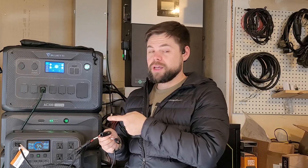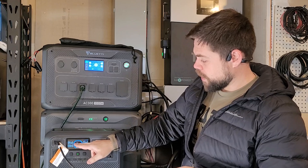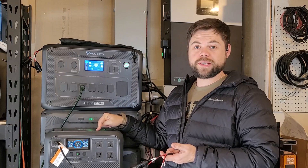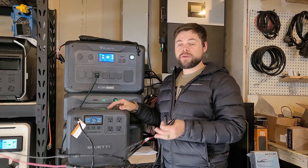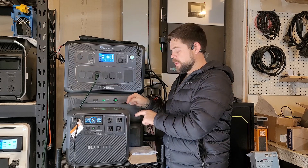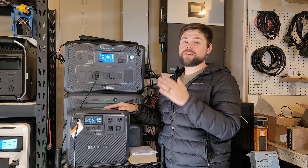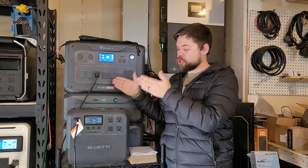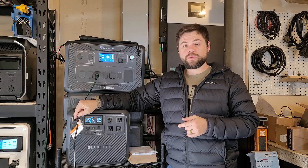The fact that I was able to do it on the Elite compared to the AC300 — I couldn't do that on here — is pretty impressive. Right now I'm getting 555 watts and we were only getting around 400 watts on the AC300, so in some ways the charge controller is better on the Elite versus the AC300 in terms of what it'll let through on a single leg. Now if I really wanted to fast charge this I could have a gas generator recharging this as well as solar input and get this whole thing recharged in under an hour — very impressive for a grid-down situation, since I got about 20 to 21 hours of runtime for my fridge. I can basically exchange 20 hours of fridge runtime off a battery for one hour of gasoline recharging, as long as that's mixed with solar.